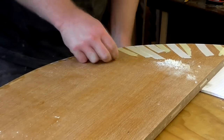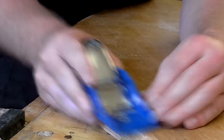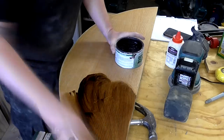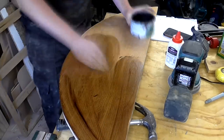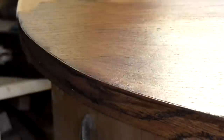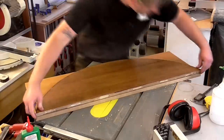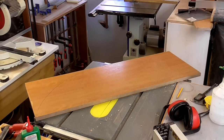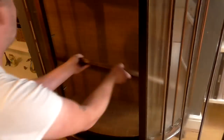After a few hours I removed the tape and used a block plane to flush trim the edge banding to the shelf. I didn't have enough dark teak stain left to do the shelves, so to get them to better match the rest of the unit I used some walnut coloured Briwax instead — I wasn't really trying for a perfect match, just a better one. With one shelf finished, I marked up the shape onto another piece and made the second shelf in the same way. Then it was time to fit the shelves — getting them in through the doors and onto the pins needed to be done in a certain order, otherwise they just wouldn't fit.